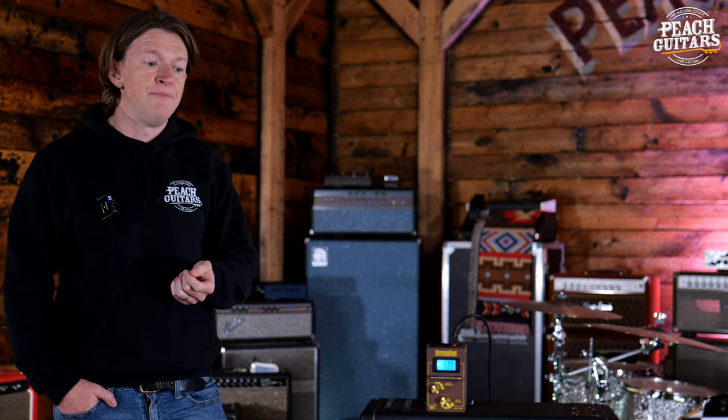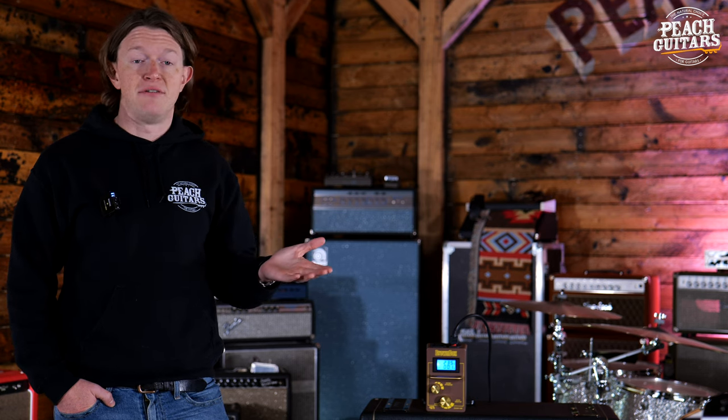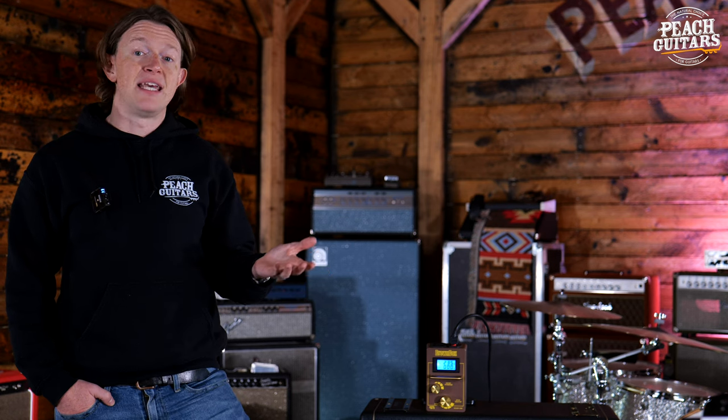if it does increase by a few volts. Like I said earlier, when we first plugged it in we were at 246 volts, and if you then get a spike in voltages as well, the amplifier should be running at 230, you could be getting anything up to 250, which probably does explain a lot of the fuse blowing events that are happening. So I'm sure anybody watching this that's had really nice tube amps and valve amps might have experienced that in the past as well.